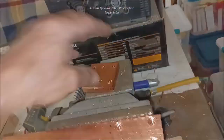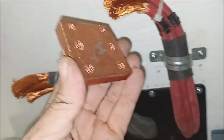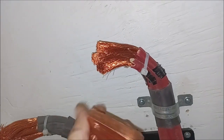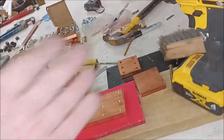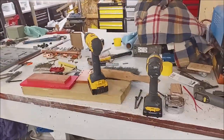These bolts will go through and come out the other side. This is the plate right here - inside there's an H or I shape. This is the plate that when put in here will clamp all that wire together and it'll practically smash flat when it does. I'll hit this with a paddle wheel grinder and freshen it up the same way so that it has less oxidation. Then we're going to be using a conductive cream or grease on there - that works great for terminals and things like that. Let's get this finished and I'll show you it coming up on the wall.